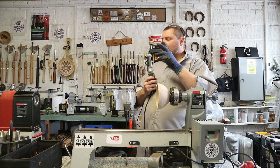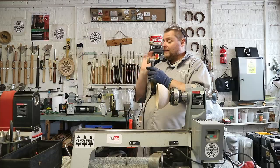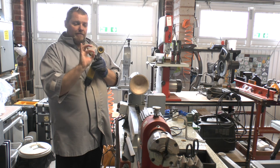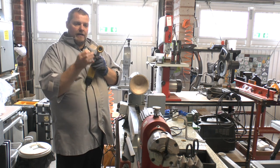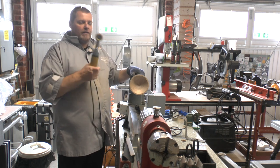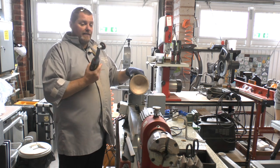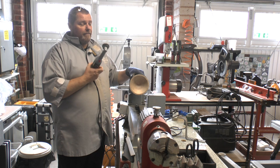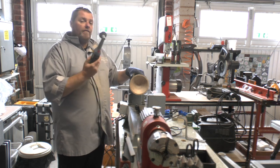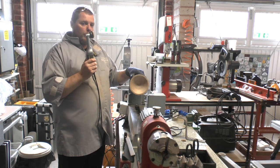with a medium, I believe, saber-tooth carbide disc. And this is my favoured disc because it's not too aggressive. I like the way the radius gives me control on the work. And the beauty about these machines is because they're not viciously powered, they're not intimidating. They spin a lot slower than a conventional angle grinder. But I would also stress, just because it spins slower, do not ever be tempted to force one of these tools. Please just let the carbide do the work.